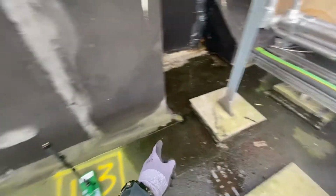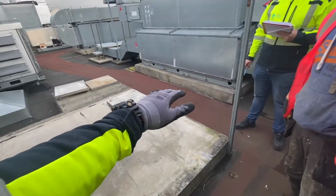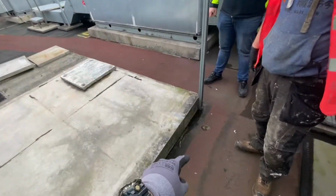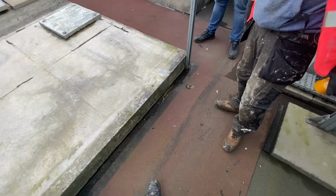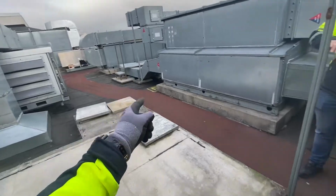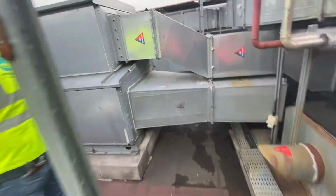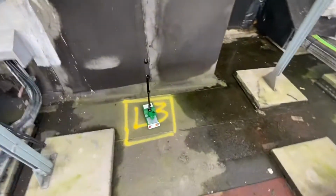See, parallel felt is great if it has the right fall. If you have torrential rain and all the water falls down from the roof into the outlets, a roof like that will be safe and it will last long. But the problem on those roofs is that they always have permanently ponding water, and in some cases even up to 4 inches. And this roof is a perfect example of it. So that's why we're doing those scans.